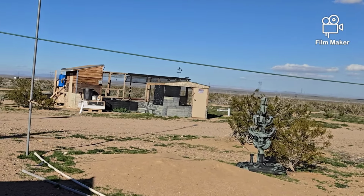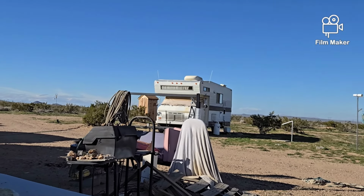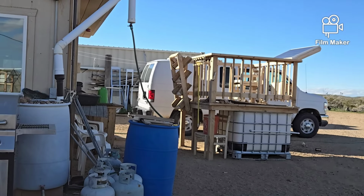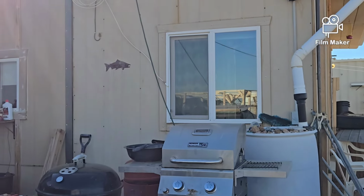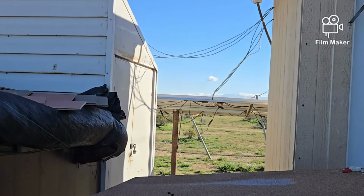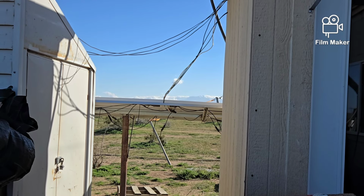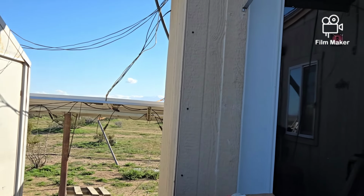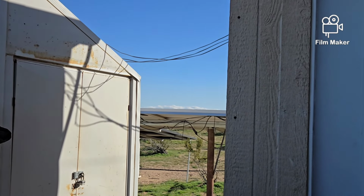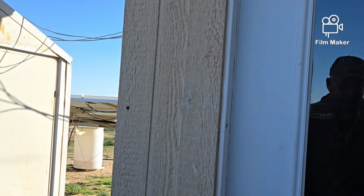And you can find those online, and if you have any background for electricity at all, if you know anything, even a little bit about electricity, you can buy used solar panels, and some of the used solar panels won't be putting out any energy. And you say, it's no good, I gotta throw it away, I wasted the money. No, it's a very simple repair. It's most likely a diode or two burnt out in it, and you can replace the diodes very easily if you know how to do a little bit of soldering. So that's one way to go.